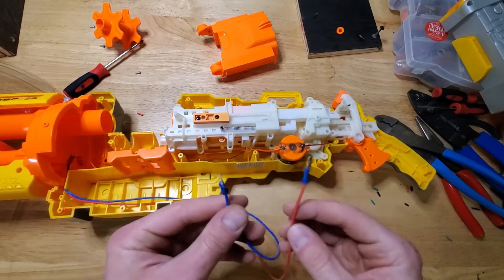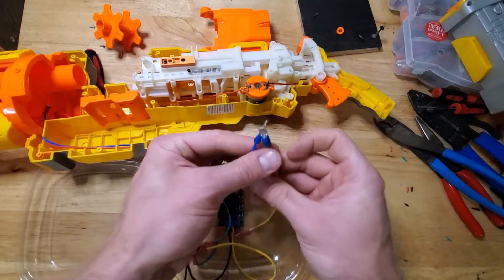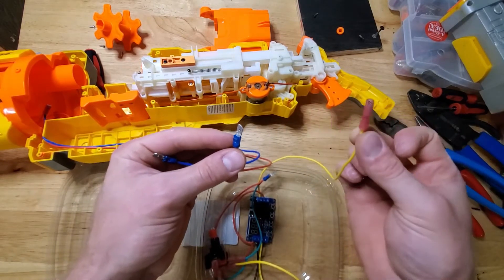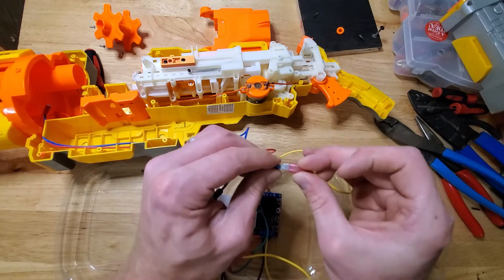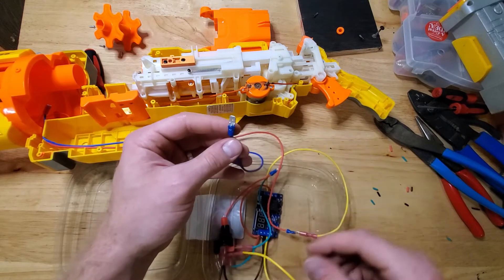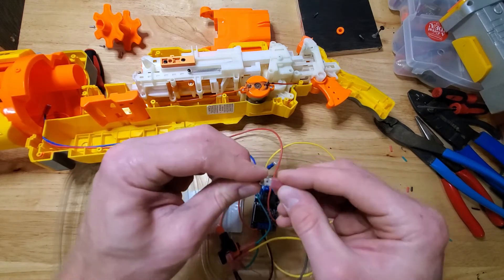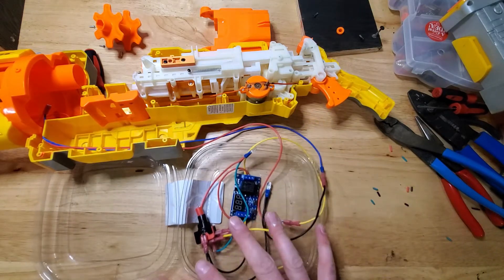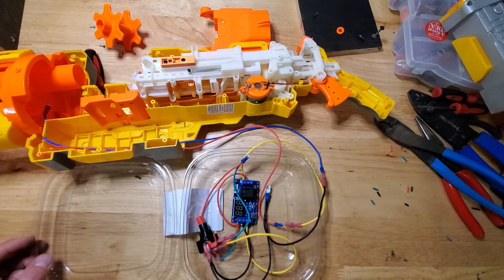Put the gun back together with your power coming in through one side running to the motor, and your ground coming off the motor — they just come out the bottom. All you have to do is connect the yellow trigger wire from the trigger terminal on your board to your gun, and your ground to your ground, and now your board setup is connected to your Nerf gun.